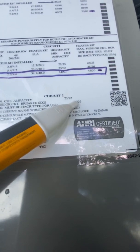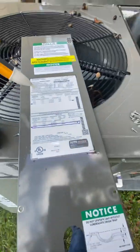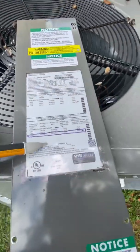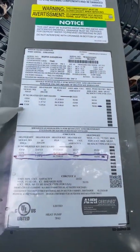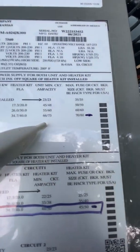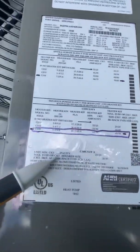Number 10 wire on a 35 amp breaker. Just to recap: check for your heat kit, mark it, figure out what your options are. 73 is your ampacity, 80 is your circuit breaker for the single circuit option — or you can do it the two-circuit way.